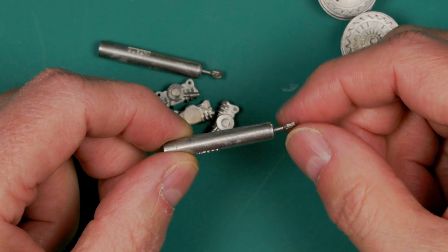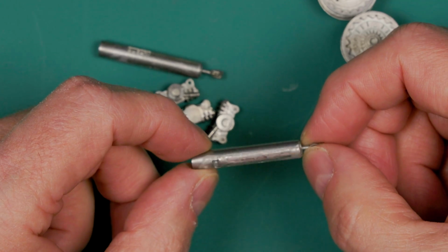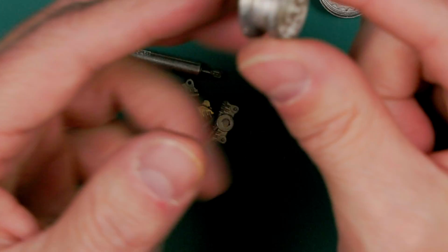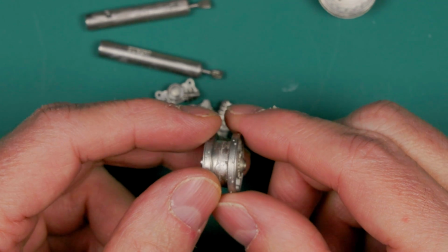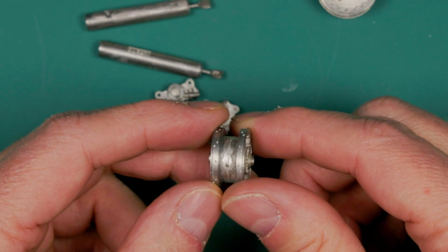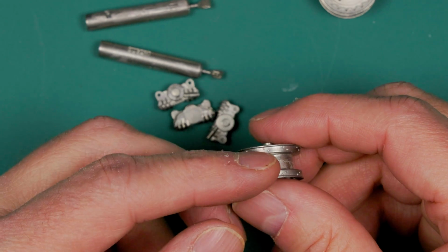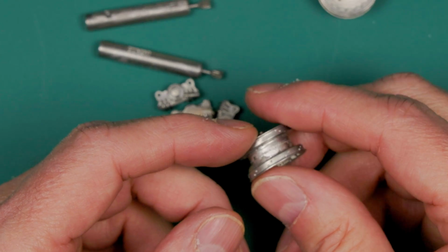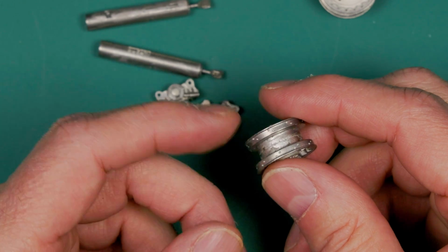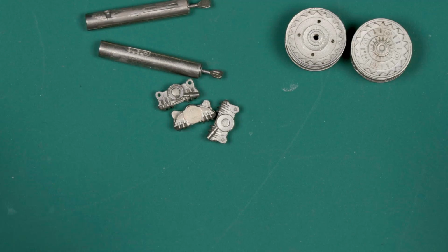So that's a big advantage of it, is you can fill a joint on something that you're going to polish, or machine, like I'm going to do on these. I'm going to machine them. I'll probably paint these. I don't know if I'll leave them a natural finish, but regardless, I'll machine them, and even when I paint it, it'll look like a continuous one-piece machined hub. So that's the advantages there.